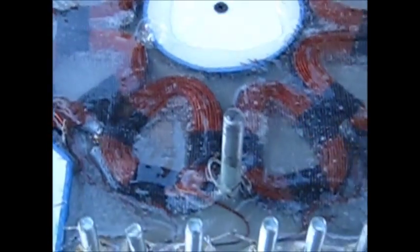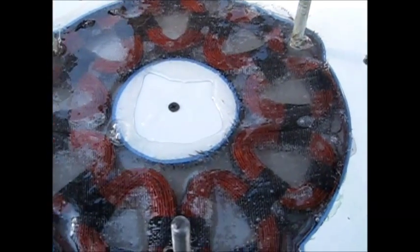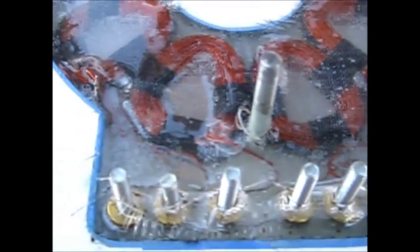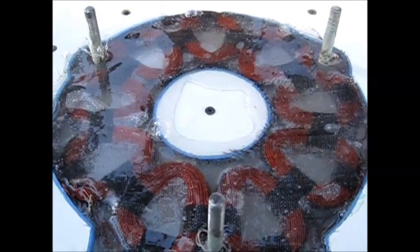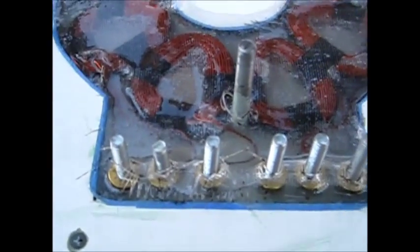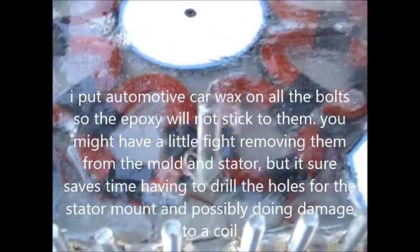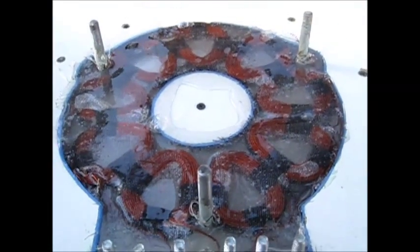Hey guys, we got the stator solution poured. There were a few little steps I didn't get to show you, but there were two layers of fiberglass inside here — the last one was cut so the circle would clear around through here. I've got a little bit too much solution in there now, because you want it to ooze out on the sides. I'm going to put the cover on this now and let it cure up — hopefully the next video we're pulling out a nice stator. What I also did is pulled out all these bolts individually and put a coat of automotive wax on them so the solution won't stick, and that way you can work them out without doing any damage to the stator.